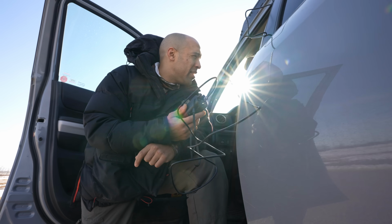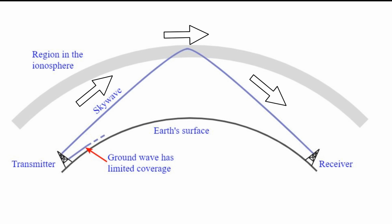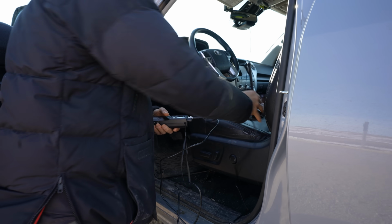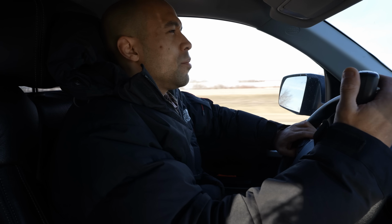Another advantage of CB radio is that you can utilize something called single sideband propagation. Now, I'm not going to go into great depth about this, but it basically allows you to skip the signal off the ionosphere. Because the CB radio uses a lower frequency than GMRS or FRS, it enables you to bounce that wave off of the ionosphere to potentially communicate with people hundreds of miles away. The only downside with single sideband is that it's not reliable because it can be greatly influenced by atmospheric or geomagnetic interference. For more information on this, I'll post a video in the description below.